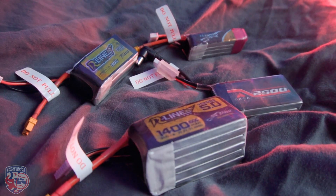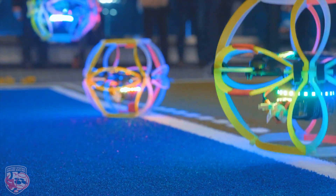Quick safety rules cheat sheet. Always pick up the LiPo by its body, never by the leads. Don't charge your battery immediately after using it — wait until it's completely cooled down. Charge batteries at 1C or less in balance mode. Never use or charge a damaged battery — if it has visible damage or is becoming puffy like a pillow, do not use it. Don't overcharge the battery; check occasionally during charging. Don't leave batteries in the sun. Always check battery cell state with a LiPo checker. If one cell gets damaged and can't be read, ask your teacher what to do.